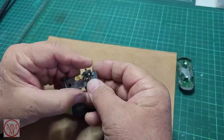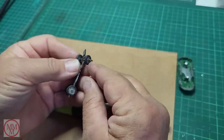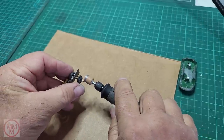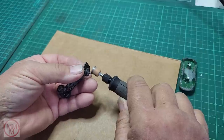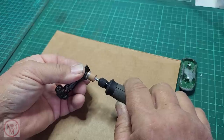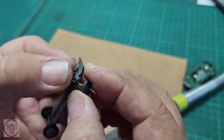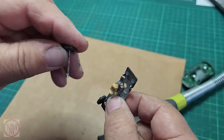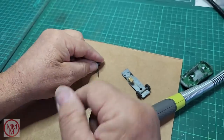I've got to take these wheels off and axles before I can work on it. This one here, I thought would be quite easy because it's broken. I could poke it all the way through, but I can't use my standard practice or method, which is where I let the axle rotate against the grinding tool. Today I had to move the grinding tool around the axle because it wouldn't spin, because it was in there on an angle, you see. It's also got a bit of a bend in it too. I have to be straightening that out before I put it back in.